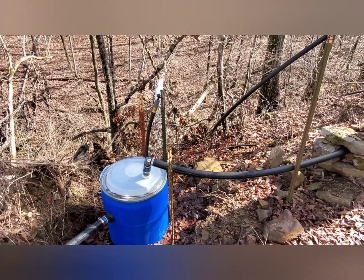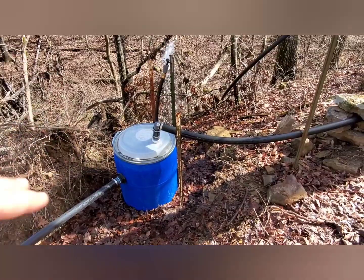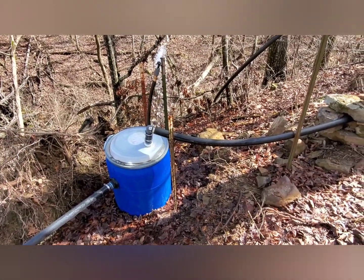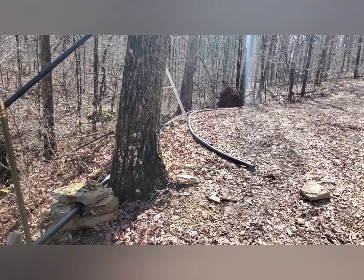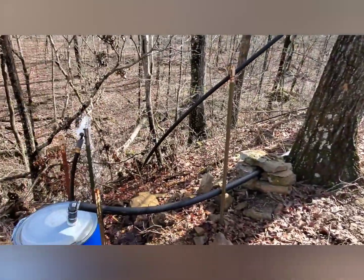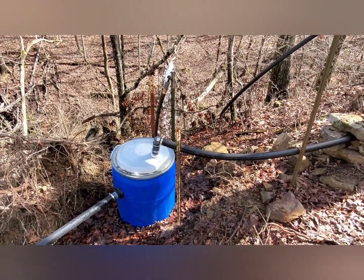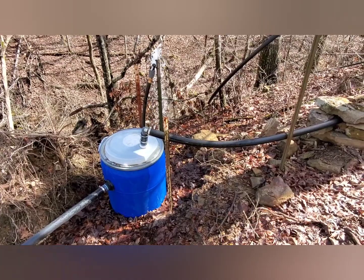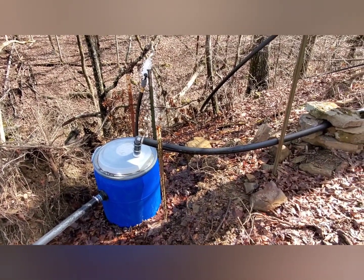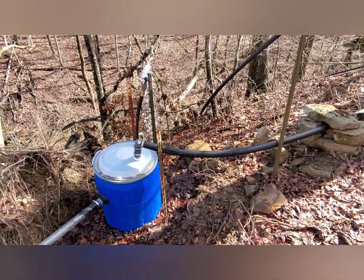Down at the turbine, just the pressure created from the barrel down — still remaining from the pressure created from the barrel to the collection box — we're reading almost 70 PSI at the turbine. So we could get a little more pressure, obviously, if we didn't have an open vent line here.